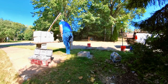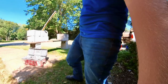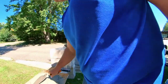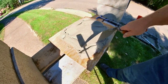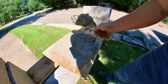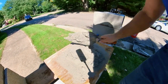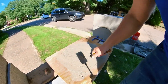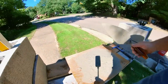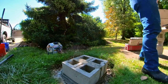So one of those things, which I'm doing right now, that I wasn't even thinking of: my mud started to get spread out. As you use it, it spreads out. Well, when it spreads out, you end up with all these little clumps. You end up with little clumps on the sides, and they start to dry out more. And it's inconsistent. So while on the board, when the mud starts to get spread out, I'll pile it back up. And that makes it so you can work with it for longer. So the first thing we're going to go over here is spreading.